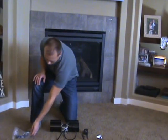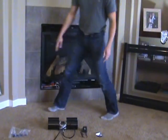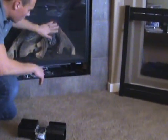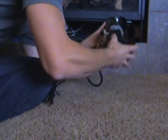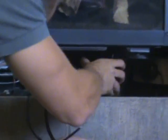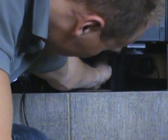So what we do for the installation is first, we'll either flip up the top or flip up the bottom, or remove the whole front panel to get into this space. Because the blower is actually going to go in this cavity between the actual firebox where the heat is generated and the space down here where the gas valve and other controls are. We'll take our fireplace blower and slide it into place — it can be a snug fit, but slide it in and put it most of the way back, leaving about a half inch between the back wall and the blower itself. Then we'll take this cord and plug it into the outlet labeled fan.